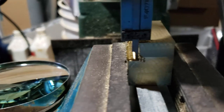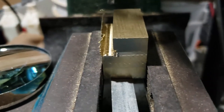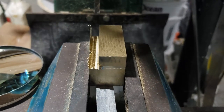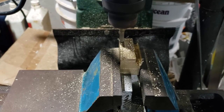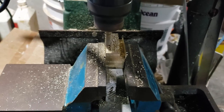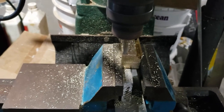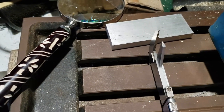I've decided to make this out of brass. Now I could have done it out of steel, but I don't really machine a lot of steel mostly because my shop is in my fish room and steel just doesn't last - it gets rusty and I'd have to do a lot of extra care or treatment. Whereas brass is fine, it will stay like this forever. It might get a little tarnished in the end, but that's no big deal, it won't rust which is what I'm concerned about. I bought these four chunks of brass as off-cuts. It's a lot cheaper to buy brass this way - I go into the metal shop, look through the racks of off-cuts, pick out what's close to what I want, and I get a discount. Brass is not cheap, so anything I can save is a good thing.